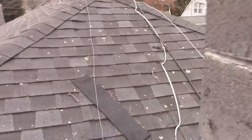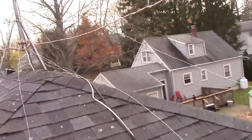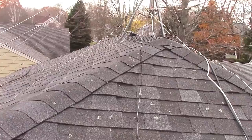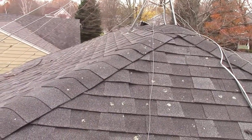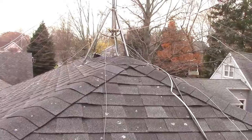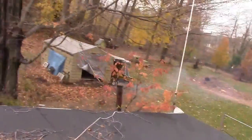Okay, so this is the antenna I was talking about — that's a vertical, but it needs these radials in order for it to work. It doesn't so much need those for a good SWR, it needs them so it will actually transmit the way it's supposed to. So that's that. I still have to straighten these wires out, but I'm going to wait and take care of that another day. Alright, let me do my tarring.